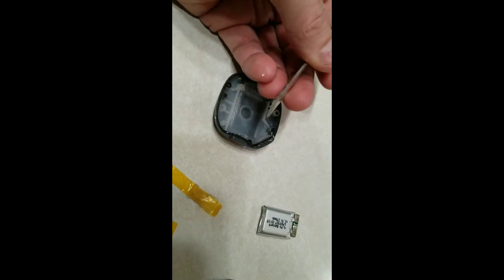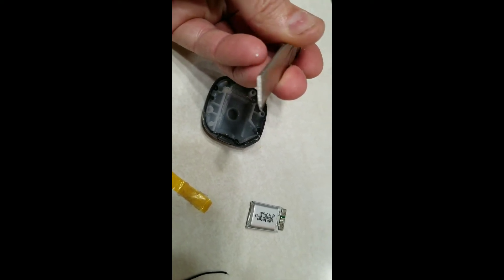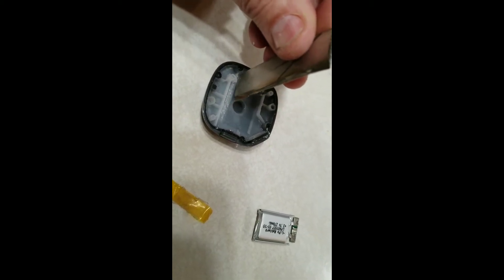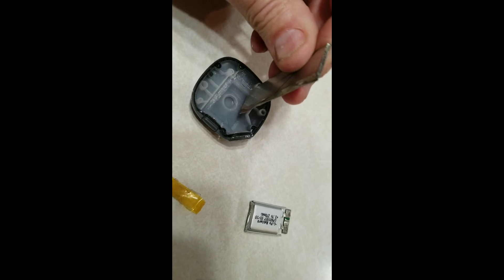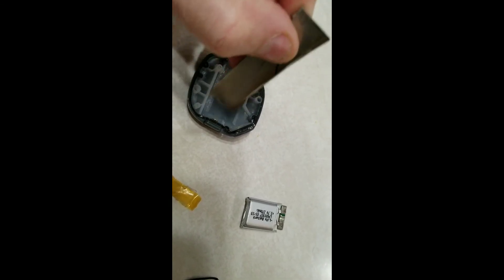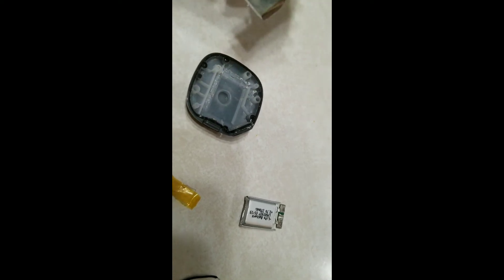I made myself a little tool — I took a little piece of stainless and I ground the edge of it to create a little scraper blade. I'm using that to scrape the plastic in the bottom of this to remove the burrs from when I snipped out the webbing, just scraping this along to smooth out the bottom of the cover.